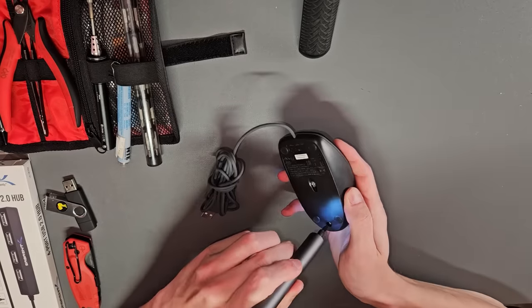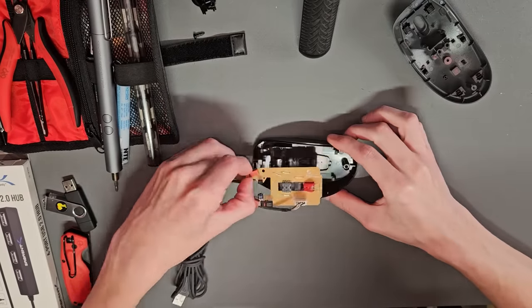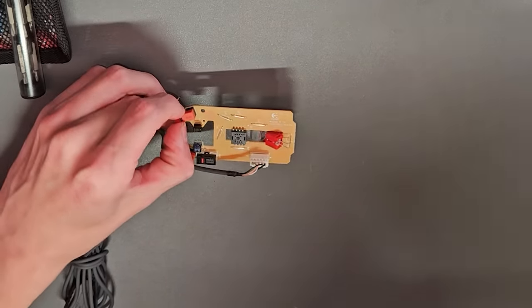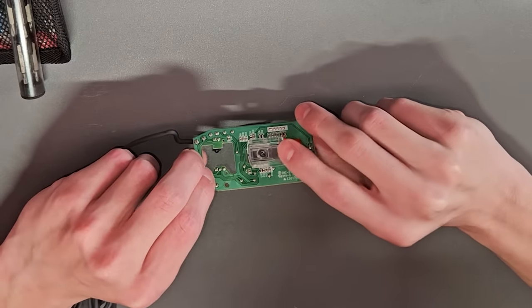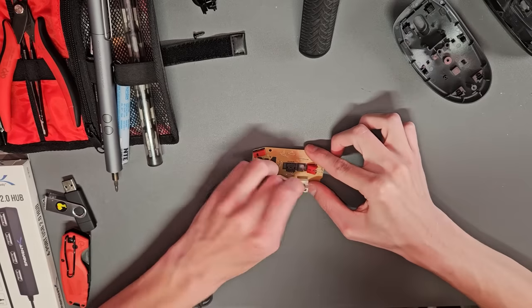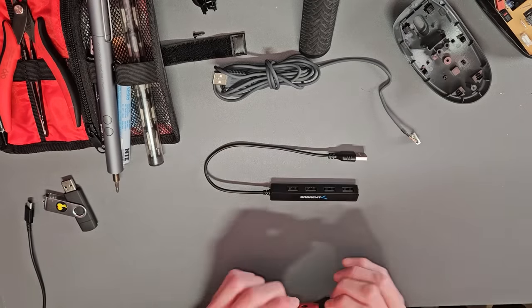Obviously this hub is a little on the big side, so we're going to look at how to cut that down. Starting off, we're going to take apart our Logitech mouse. We're using a Logitech K210 set here — it comes with a keyboard. It's made extremely cheaply: it's a single-sided board like you'd see from old Radio Shack kits, and it uses through-hole jumpers to keep the cost down. No vias, nothing like that. Really simple.